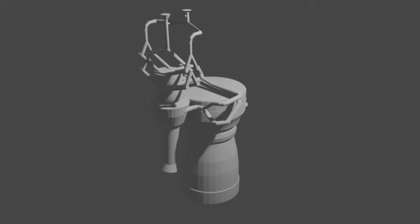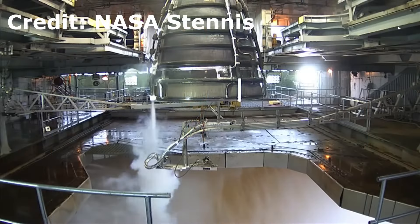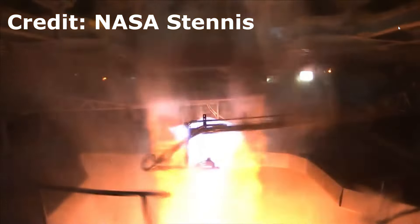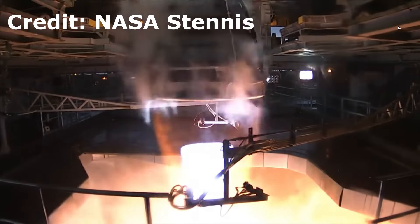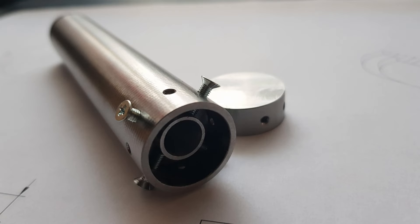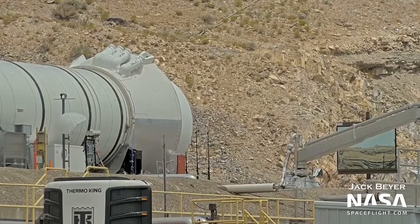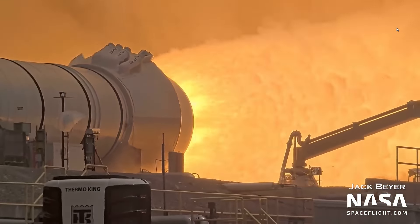There are three types of rocket engines. Solid rocket engines that burn a pre-mixed propellant combination in a designed and expected way. Liquid rocket engines which burn two or more propellants in a design mixture to get high working fluid or exhaust temperature and low molecular weight. And of course, hybrid rocket engines which are better. For this project I'm going to design a solid rocket engine because it's the cheapest and easiest way to get the specific combustion properties required for a rocket engine.